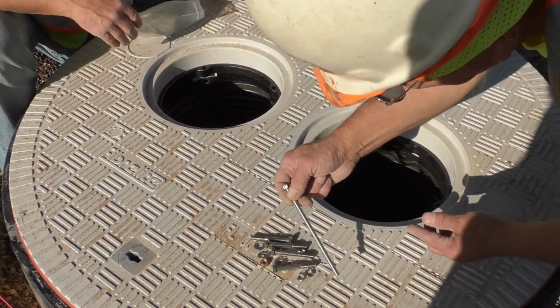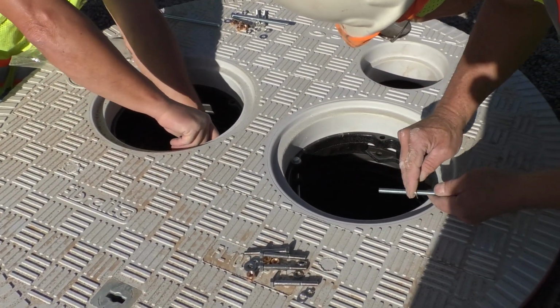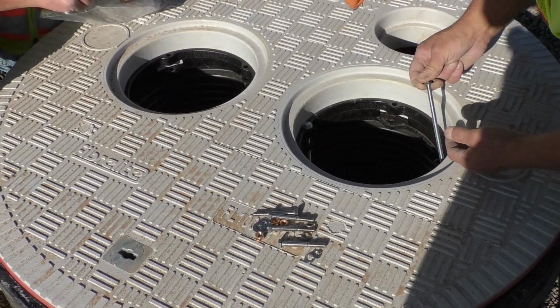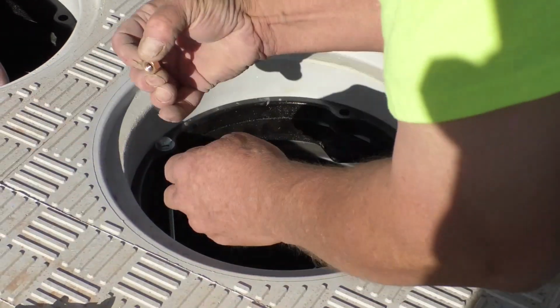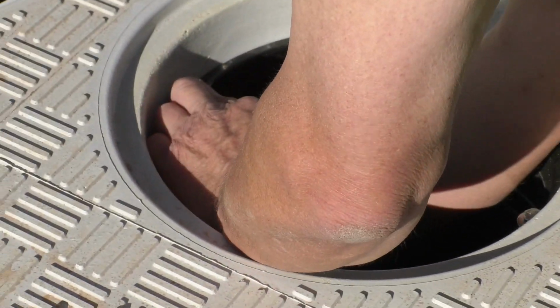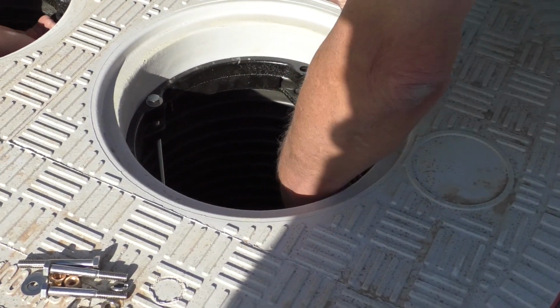The spill buckets must be bolted to the multiport prior to pouring concrete. This will prevent the frame from moving during the installation of concrete. If this step is ignored and the frame is not properly aligned with the spill buckets after the tank pad cures, it will be necessary to break concrete and reinstall the frame.